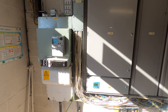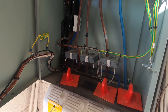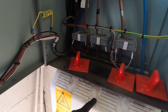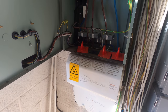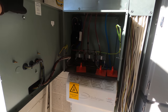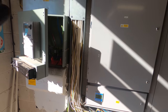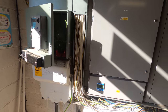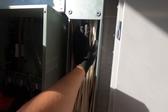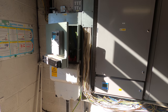The incoming comes around in some really small trunking and into the bottomless MCCB panels. At the minute they're 70s, we're going to 150s. I think there's either 100 or 150 amp fuses in here. We need to go to 250 and the DNO have specified 150mm tails, so it's going to be really really tight. We are going to make them aware of this - the trunking is at maximum capacity and should never be filled like that.